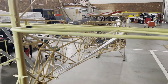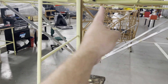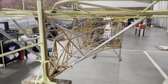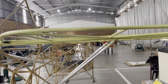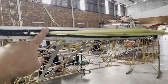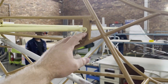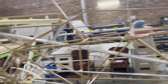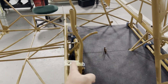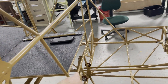Moving to the elevator: we've installed the elevator and tail plane on the back of the plane. The elevator is nice and level and square to the post, and you've also leveled the fuselage and confirmed the spar is level. We clamp the elevator in the neutral position, approximately in the middle. With the elevator and tail plane locked and the control column locked at five degrees forward, the push rod is approximately 738 millimeters to the idler.